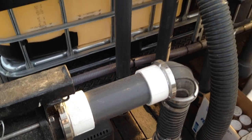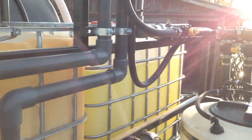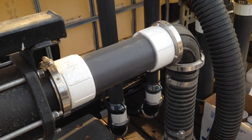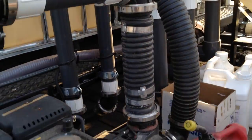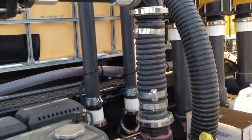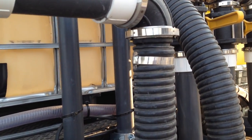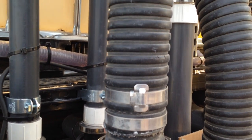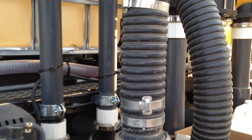We empty the solution tank out and then fill the remainder out of tank one and tank four. We used Schedule 80 PVC where we could, hose everywhere else. We tried to stick with banjo flange clamps and stay away from threaded fittings. We made our own clamps with stainless bands.